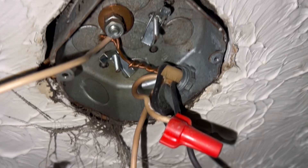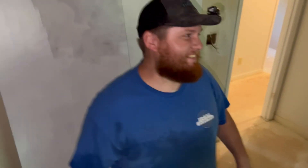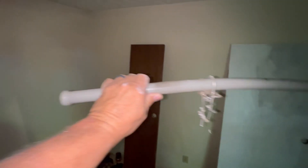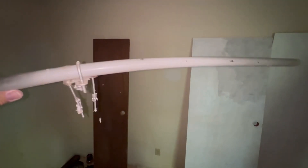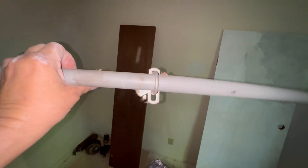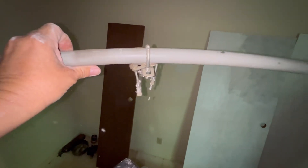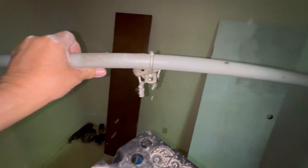Did you see copper? It's PVC. So this is what was hanging the fan in the attic over some joists. I can't be mad at them really for trying, but the reason the box was sagging and flopping was because they used PVC. If they used a piece of metal, it wouldn't have become a banana up there in the hot Georgia sun and let the whole thing just sag.